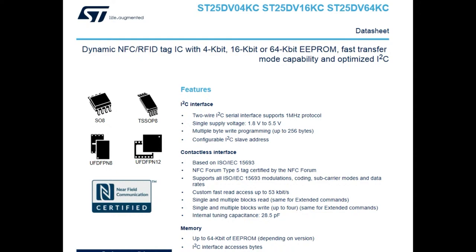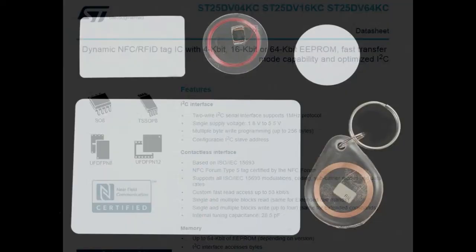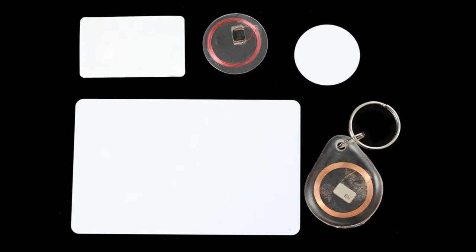It comes in a bunch of different packages — you can see it comes in four different packages there. It's an NFC chip. When a lot of people talk about RFID or NFC, they think about RFID tags that look like a card, sticker, or circular tag. But if you look at the clear tag or clear key fob, you see there is an antenna made of coil and wire — kind of like magnet wire, so it's reddish or orangish. And in the center there's a silvery blob with only two pads on it.